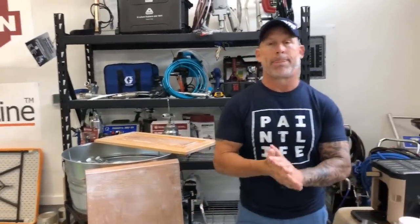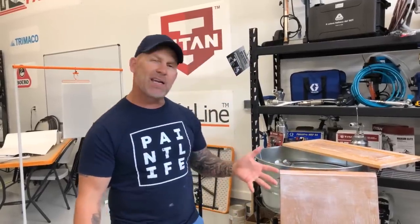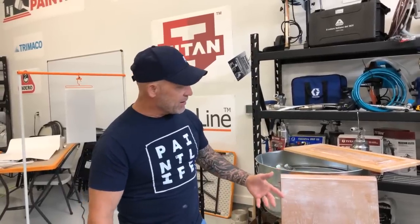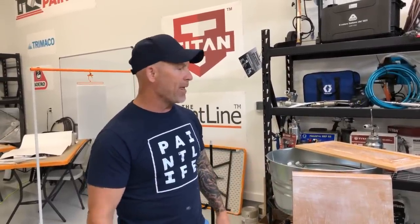Dave has a question. Let's go a little slower so we can answer these questions. How long can you leave Aqua Coat on before priming and painting? Once you put the Aqua Coat on, it dries really fast. Out here, I was sanding it in about 15 minutes. And once it's sanded, it could sit. This has been sitting. I started working on this several weeks ago because we've been traveling a lot. I could come back in a week, a month, or even a year and then paint it. It dries hard.